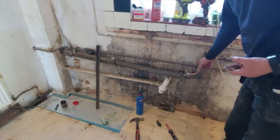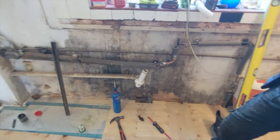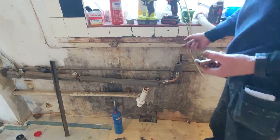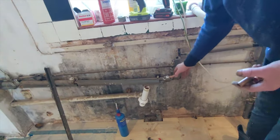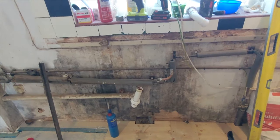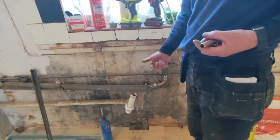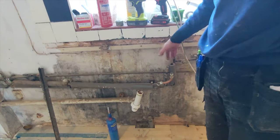The only issue I'm going to have are these valves. Because unless you switch the water off, in an ideal world these want to come through the cupboard for easy access. I can't twist them through the cupboard and I can't take this off because there's still water. So it might just be a case of saying to your neighbours, look, I need the water off for an hour, and then we rejig it and put it how we want it. That way the isolation valves are through the cupboard for easy access, and if I replace them, I know they're new.